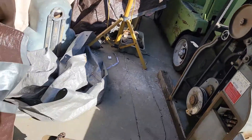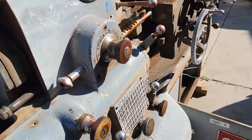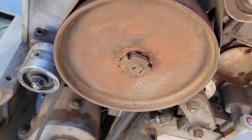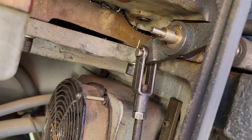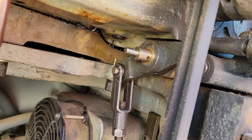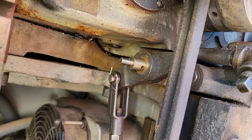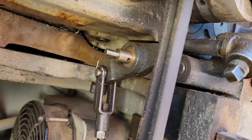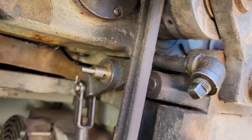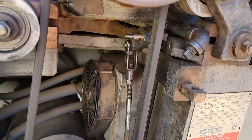So I went ahead and picked up this off of eBay, and it goes right here and comes down here. I've got the collar and then there's a little bevel gear — it's an off-the-shelf Boston Gear thing — that mounts here. And that's where I started to get all the parts to mount the potentiometer, like I've seen on other Monarchs and like my buddy's Monarch is.